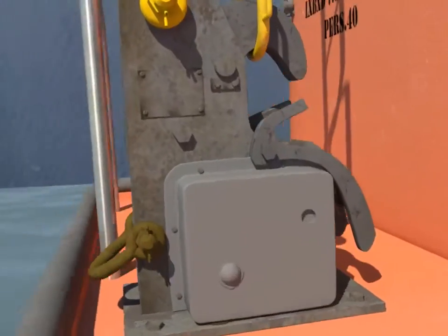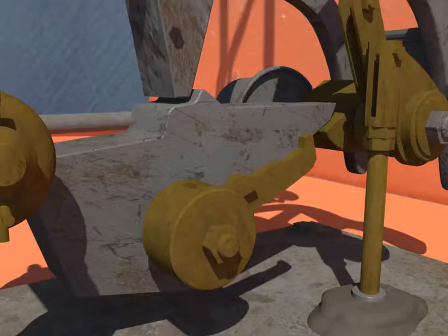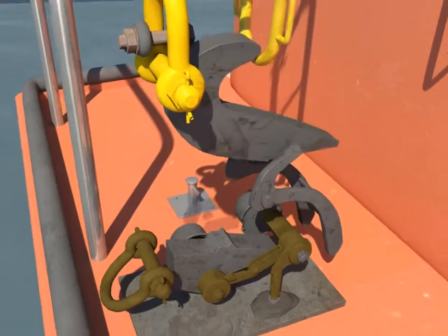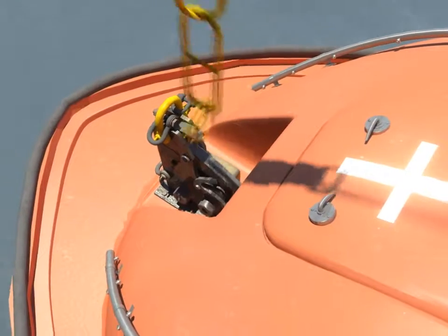The moving cam release pin pushes the spring-loaded external lug of the amplifying arm down. The rotating cam release pin inside the plates frees the amplifying arm, which is locking the hook. The amplifying arm is now free and allows the hook to release the fall.